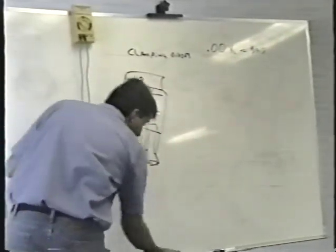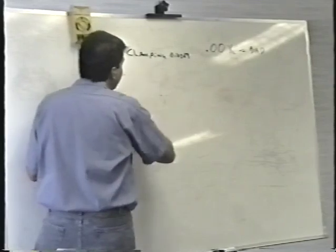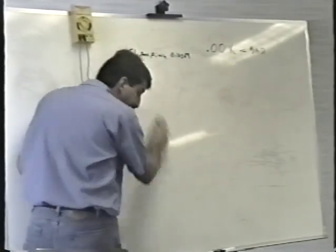Man, that's simple. When I get to a power supply and the fuse is okay, I just whip right on those diodes. Most of the time, it's a plus 12 or a minus 5 volt diode that is bad. It's very, very, very common. There is a remote possibility that the plus 5 volt diode is bad. The plus 5 volt diode is the thing that lives on the other heat sink. One of the heat sinks has the two transistors on it. The other heat sink has the special plus 5 volt diode.